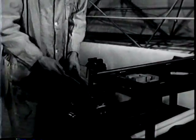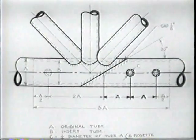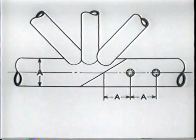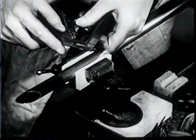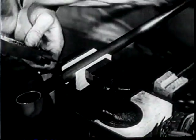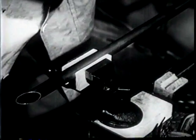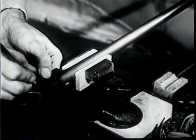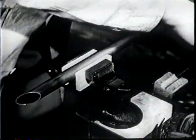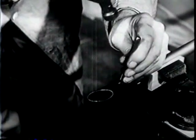Now check with the manual again for welding instructions. Specifications call for rosette holes in the replacement section, spaced as shown in the drawing — A is the diameter of the tube. Lay out your location points for the holes according to the specifications, lay out both ends of the replacement section, center punch them for drilling, and drill the rosette holes.